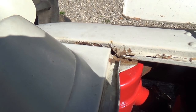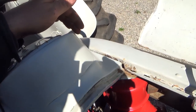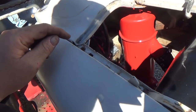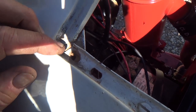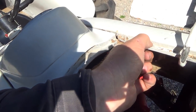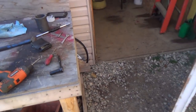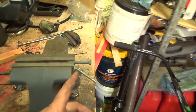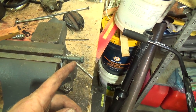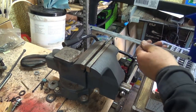She's gonna suck, but that's one that's a fine thread, and then the other one's just a hole. And I think you got to put a couple of quarters down in here. Well, that doesn't look like it lines up at all, so that just kind of holds her up like that, I guess. Yeah, a little bit more work to do. So I got to make some bolts here. We got some regular 5/16s. We're just going to cut these threads off and then re-thread fine onto this part and use that. Okay, so we'll hack this off of here.